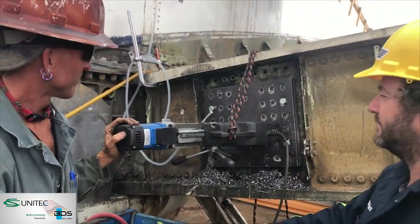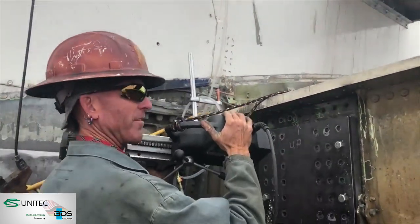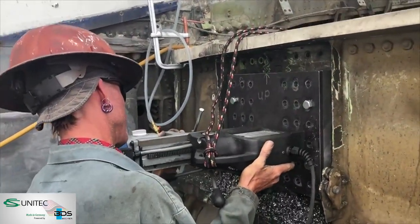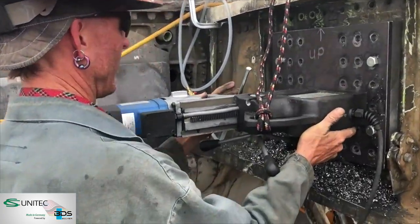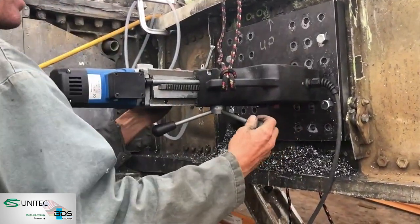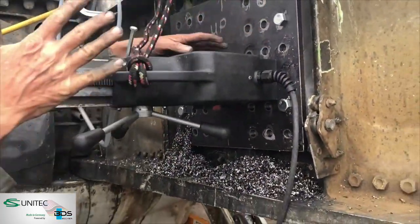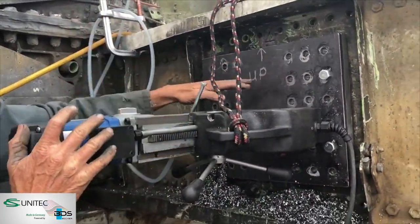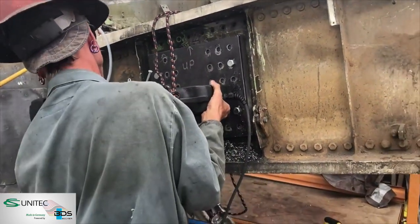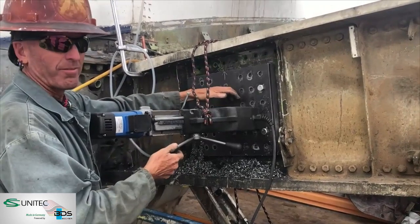It's a great tool — light enough that I can handle it and position it accurately. It's definitely a two-handed job; it weighs about 29 to 30 pounds, but that's very lightweight for the size of the motor. They have a two-stage magnet on here. While setting it up, the magnet button holds at about 50 to 75% of mag base power, so it's easy to reposition. Then once you hit the motor start switch, it switches the magnet on to full power.